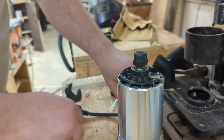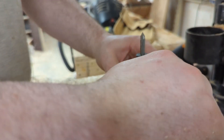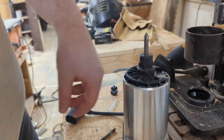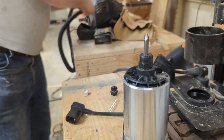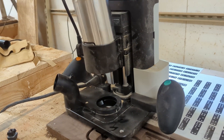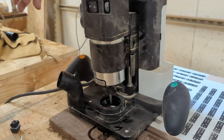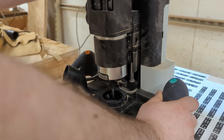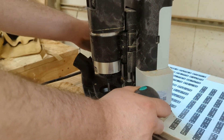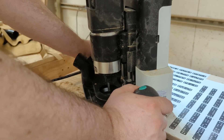When changing bits with the Shaper, you put the spindle in, and then there's a function that zeros the height — it plunges down into a piece of wood and as soon as it detects it hit the wood, it stops and says that's where the wood's at. You've got to tighten up the motor, otherwise it will slide and the zeroing will fail. Here's an example of zeroing: you hold the thing still, push the button, it drives down, bumps the ground, and retracts. You can see it tilted the machine a little bit when it bumped the ground.